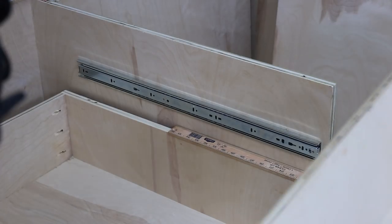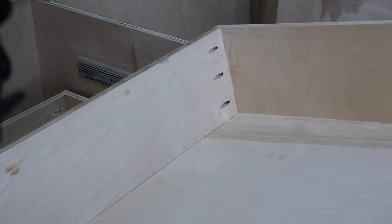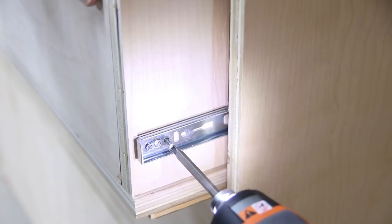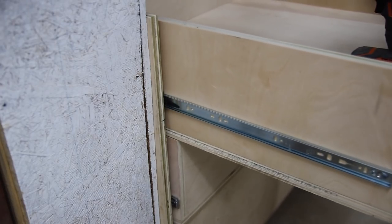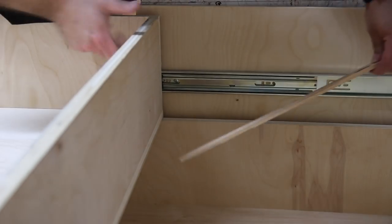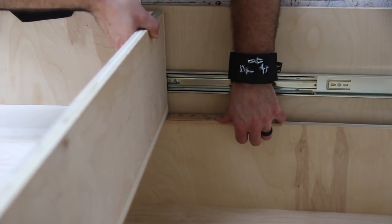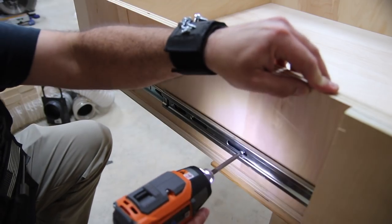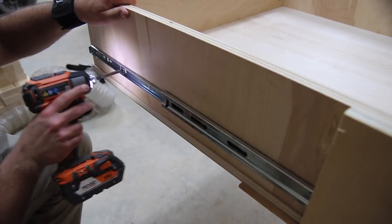Here you'll see a yardstick I'm using as a spacer to give me the required space between each drawer for it to move freely. I wanted to maximize the drawer depth, so I pull the drawer slide out just a little to the edge and secure it on both sides. Then I move the spacer to the back of the drawer — since it was starting to drag the one below — secure the drawer slide, and make sure to install screws along the full length of the slide to support the weight capacity.